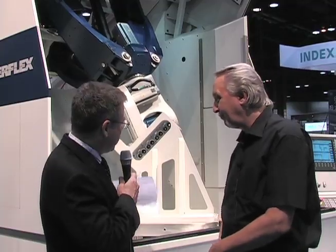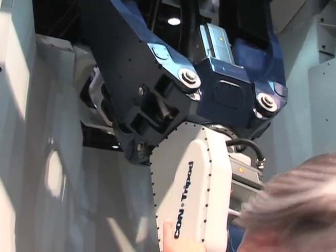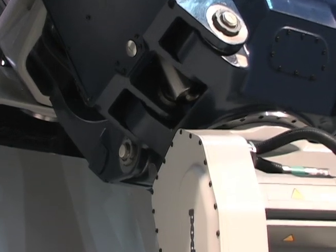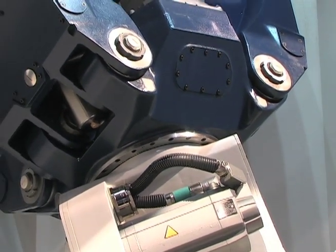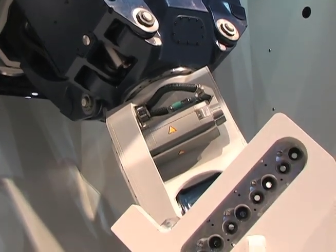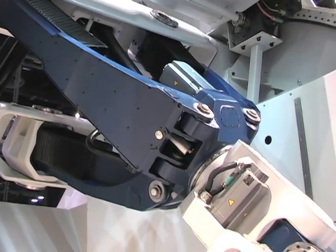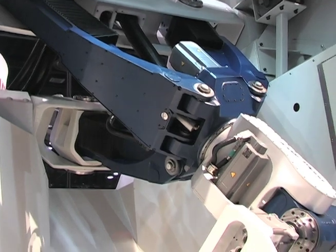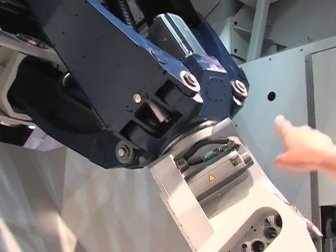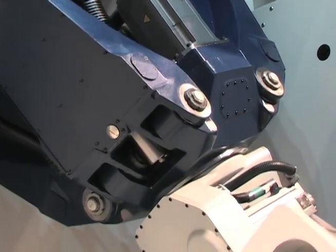So welcome into the machine. Up here you find three legs — one, two, and on the back side you can see leg number three coming forward. Those represent the upside-down camera tripod I mentioned. In other types of parallel kinematic machines, these legs were connected to the head with ball joints — like a hip or elbow joint — and a ball joint is a mechanically very bad element. In this technology, we replace those with single linkages — one, two, and three — which are the size of my lower arm, and that is the key to the stiffness and accuracy of this machine.